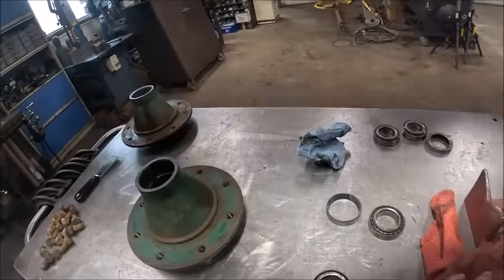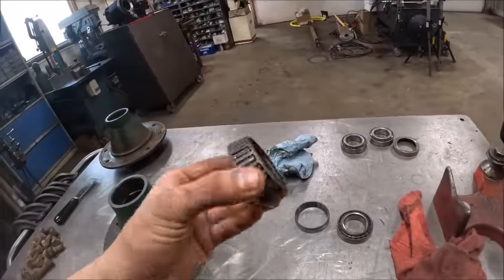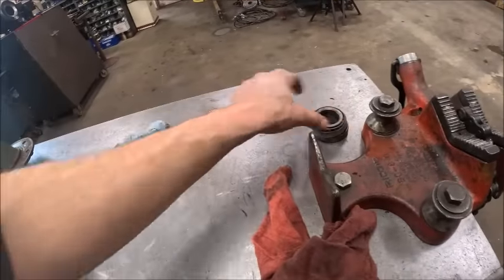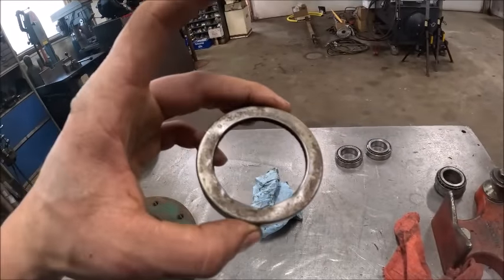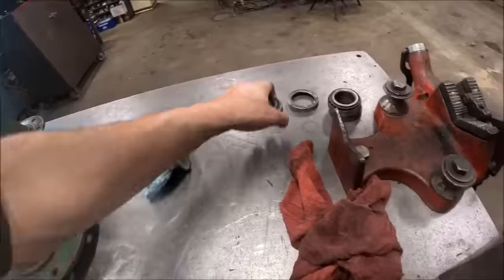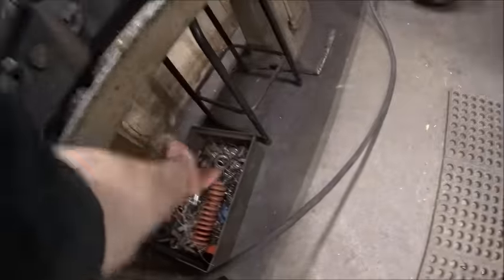This spreader that I got this axle off of was perched kind of cockeyed up on top of a scrap pile, and it had one hub part way in the ground. I'm guessing that was this hub. So we're gonna have to do wheel bearings, but luckily I found one of the seals had a good legible Chicago Rawhide number on it, and obviously the bearing cups and cones have good Timken numbers that are legible. So, I'm sorry, Timken. You're scrap.